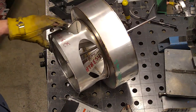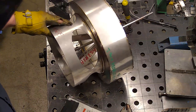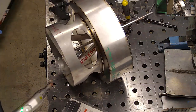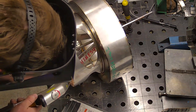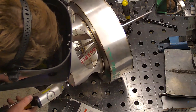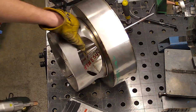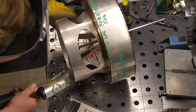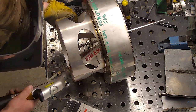I think what we're seeing is telling us that there might be a little bit of tweak to our assembly sequence that would be required if we use the laser welder. But what you've shown us so far is that the laser welder can do all these joints. Yeah, I want to see him do this joint. I tack one on top, one on bottom, and side to side. Make sure everything's square.